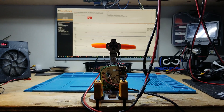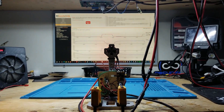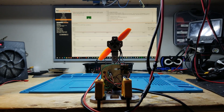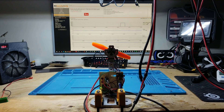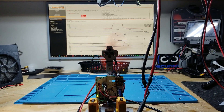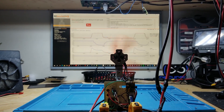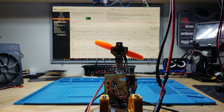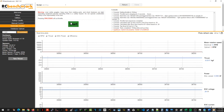This is again less efficient, by over 9%. Time for the thrust tests. On 4S, we get an average spin-up time of 164 milliseconds. Repeating on 6S — after shoving some toilet paper in my ears — we measured a spin-up time of 234 milliseconds. This is now getting worse by about 70 milliseconds. At higher RPMs, 6S becomes less performant, and this is only about 75% of the 4S equivalent maximum thrust.